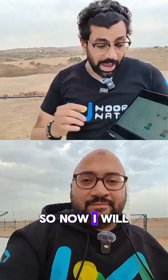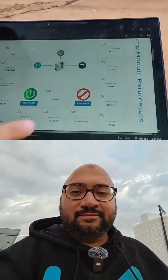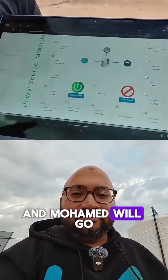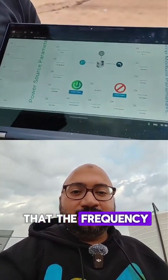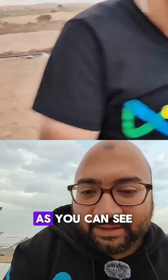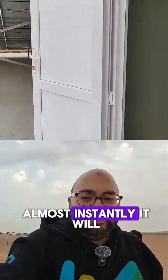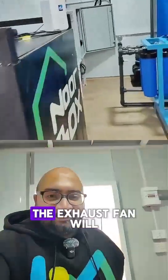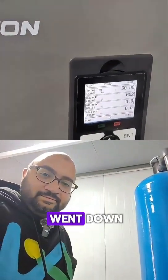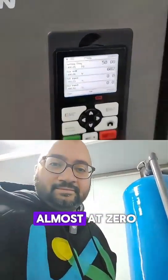Now I will switch off the inverter from the red stop pump. Mohamed will go inside and show you that the frequency and the inverter is switching off. I clicked on the stop pump. As you can see almost instantly, it will be switching off the inverter. You can see that the exhaust fan will be going down and the frequency actually went down and the ampere is almost zero.